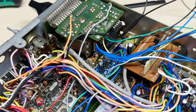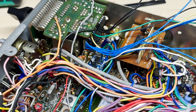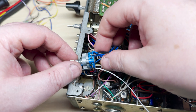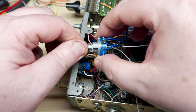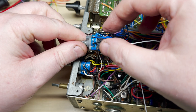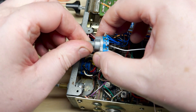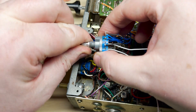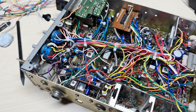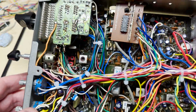There's my mod board fitted — not wired up yet — but with the mod board just plugged in we could drop straight onto mid band. I've modified the original switch: just took it apart, turned the select wafer around and made it into a five-way switch. We've cabled it up and we've got two wires for the FM offset, which are the white wires here. So there's our band switch fitted.